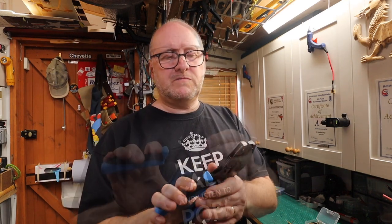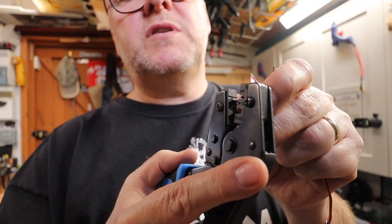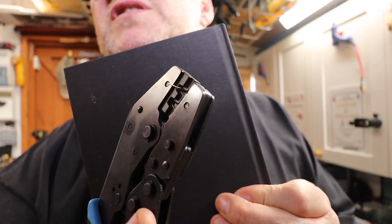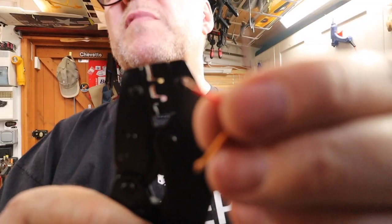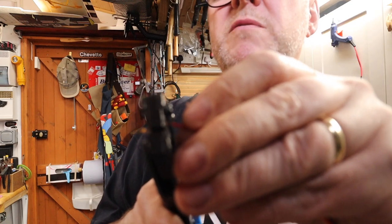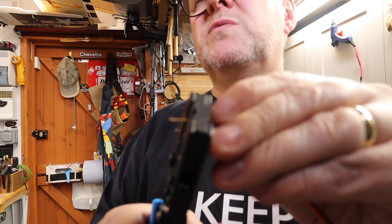Now this one has got lots of power and it's got a ratchet action. But this one is different because you can see the thickness of these jaws is a lot bigger. This will actually do both crimps at the same time. So I'm going to put the crimp into position and just close the jaws so it's just biting on it. You can see the crimp is in the jaws, just gripping in there. I've trimmed back the wire about 3mm. I'm going to position the wire into the crimp and make sure the insulation goes in only 2.5–3mm, and then squeeze it and crimp it.